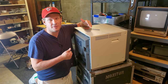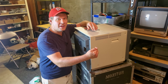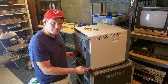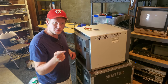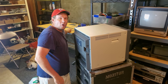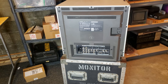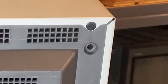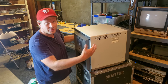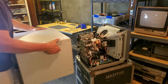Removing the back shell of the PVM is one of the easiest things you can do if you do it correctly. You want to remove three chrome screws from each side, so six chrome screws total, and then there are four black screws positioned towards the bottom and back of the shell on the plastic section. Remove those four screws — ten in total — and they are all Phillips-head screws, very easy and accessible to remove. Then all you need to do is pull back on the shell. Please do not try to remove the little plastic rivets — they can be very fragile and are very hard to find replacements for. Don't try to open this shell by separating the back panel from the hard metal shell while it's all attached. And there we go.